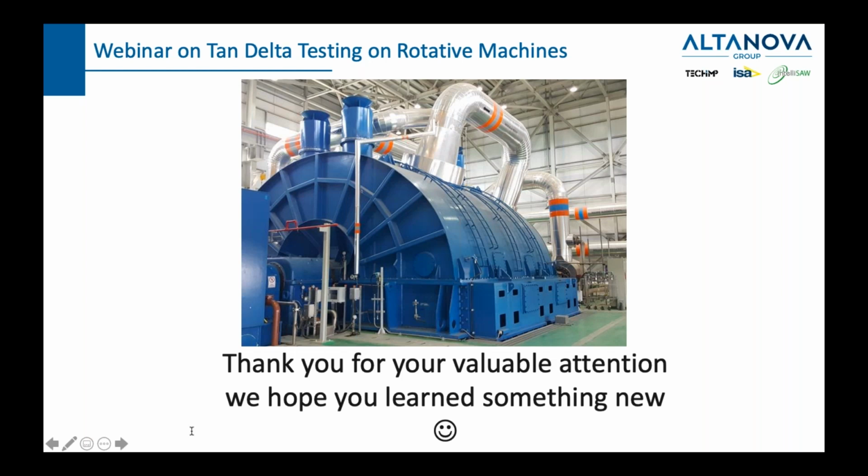1448: is this method used to determine PD in high voltage cables using tan delta? Yes, it is the same method. Once again, we can shorten this whole 1-hour presentation into 1 sentence when we describe tan delta. Tan delta is the measurement of current when I generate high voltage and understanding the phase shift between the current and the voltage. By understanding the phase shift, I understand what the resistance, or should I say the impedance, of that insulating material is, and by measuring that very accurately, I can tell you what state it is in. It's the same for cables, generators, motors, transformers, everything.